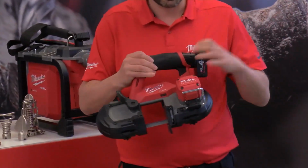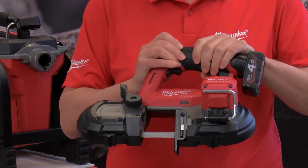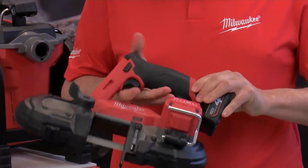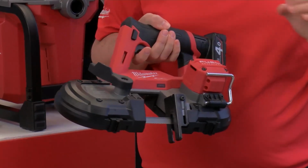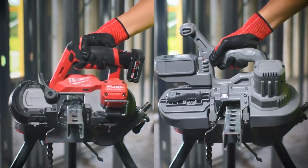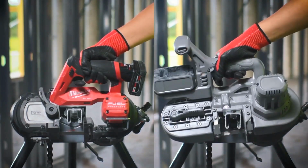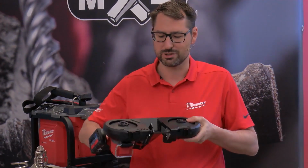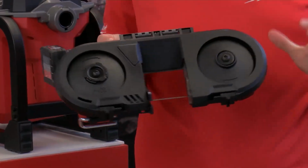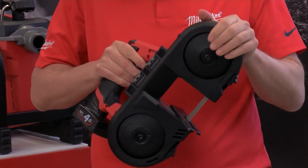And this operates by the same battery as you have used before with your copper pipe cutter, and it has a 64 millimeter cutting capacity. This saw delivers the same performance or faster cutting speed than leading 18-volt competitors in the market, as you can see here. So it's a really fast cutting product. On top of it, it has integrated safety features here, like the integrated bandsaw cover. That means when I accidentally touch the saw, I'm not hurting myself.